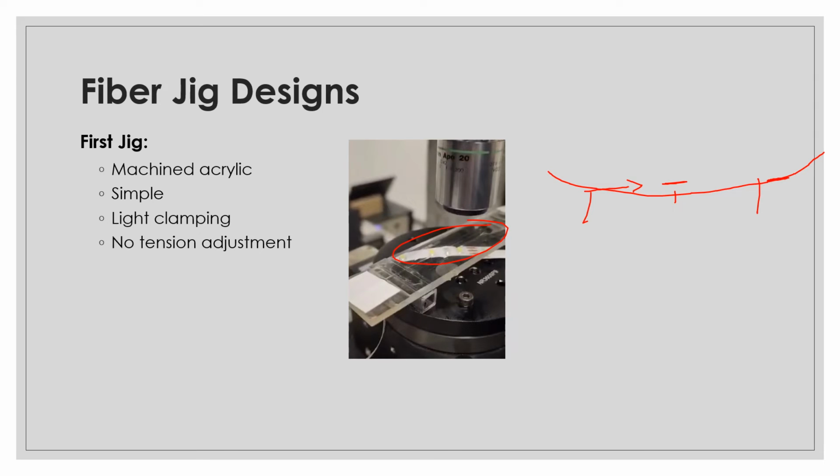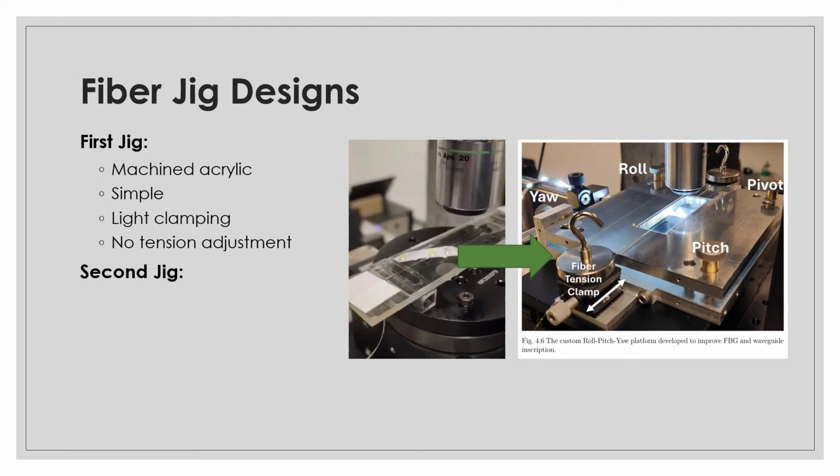And I think also, if we look at this from this direction, what we're actually seeing is the fiber is here, but it's doing this droop along its length, drooping down. Here's the core, here's the core. This is like a 3D view, and this is at the end, right? We might be writing in the core here, but by the middle we're not writing in the core anymore. We're still writing at this position, and so we got these really terrible grating resonances. We couldn't figure out why. It was a number of problems. I think it was a combination of the collimation we were using, but also this mounting. By the time we had figured out the collimation part, we could get short distances of high quality grating, but it didn't work well.